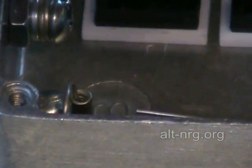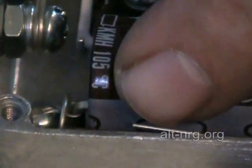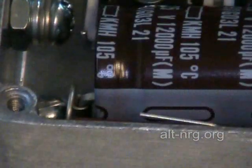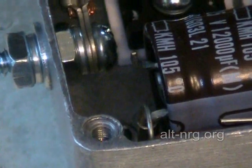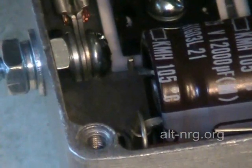This is one of the most difficult solder connections to make in this case, because this terminal is the closest to the edge of the case — it wants to suck all the heat away from what you're applying and dissipate it in the side of the case.